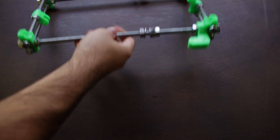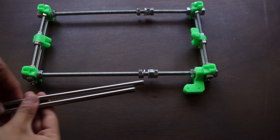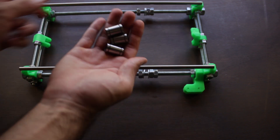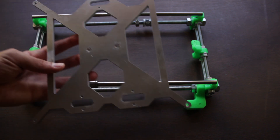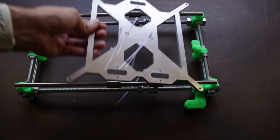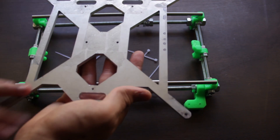At the end of last week's video we had the Y structure of the printer complete, which I have right here, and today we are going to add to the Y structure all the necessary parts to give it movement. The components we will need are two 350mm linear rods, three LM8UU linear bearings, the 6mm aluminium laser cut bed base, and a bunch of small zip ties. There are no 3D printed pieces in this episode, but I will upload the DWG file for the heated bed base as well as affiliate links to buy all the necessary components.